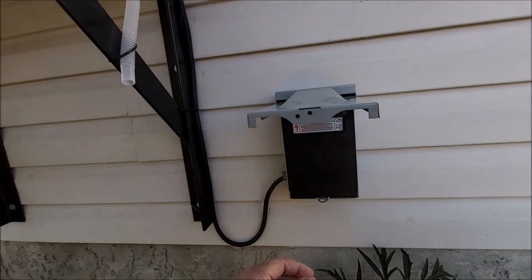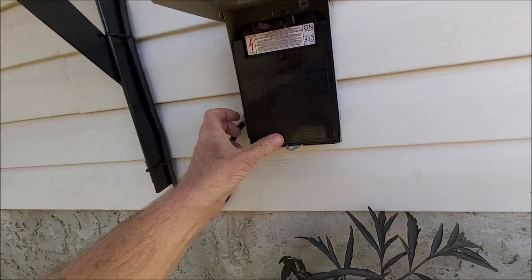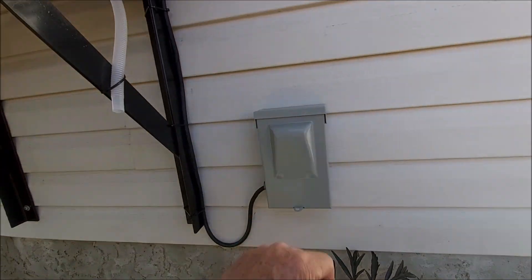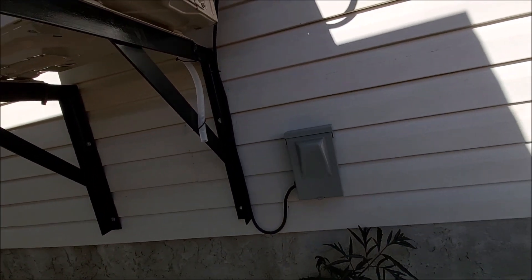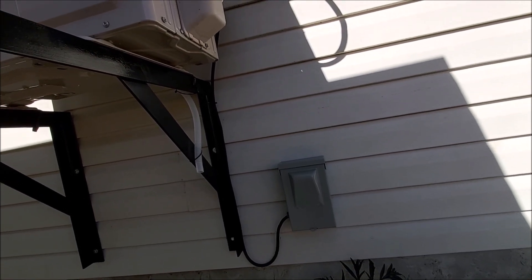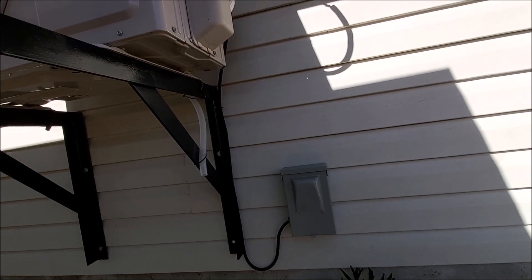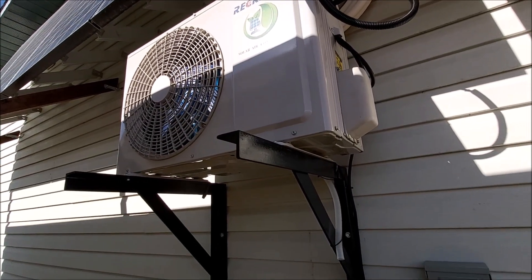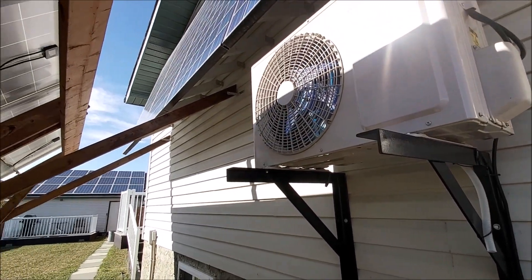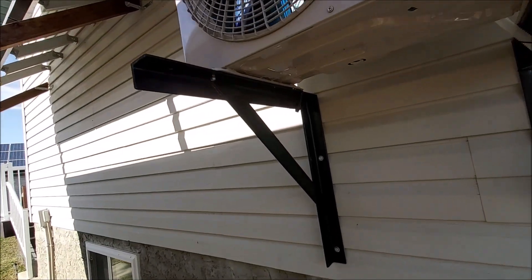There's a number 10 wire coming in — I don't want to take that off for you, there's not much to see. There's a number 10, 10-3 wire, so if I ever decide to upgrade I can run a 240-volt heat pump off of it. If this thing ever craps out I would upgrade it with a two-head heat pump.